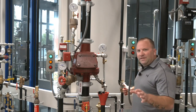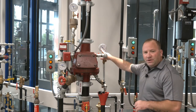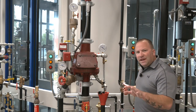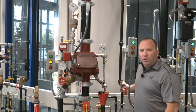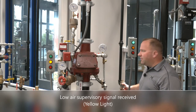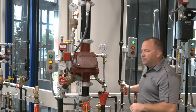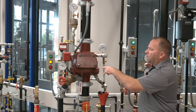As we release the air pressure from the system, our air pressure gauge is showing that our air pressure is dropping within the piping network. As the air pressure continues to drop, it should operate around 10 psi in this scenario because we have 60 pounds of water pressure and a six to one differential occurring inside the valve. Remember, the valve uses no electronics to trip — it purely works on air pressure and water pressure. As we approach that 10 psi mark, we'll hear the valve trip.